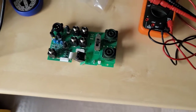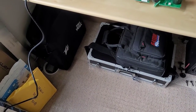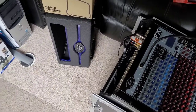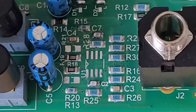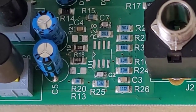The VB3 has an electronically balanced DI, and so does the Mini Mega. I've connected the Mini Mega in the same fashion to my rig — my FX2 series mixer — and I did not get any buzzing sound at all. Where the majority of the ground loop is coming from is located at resistors R21 and R20.